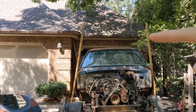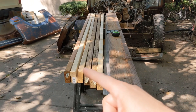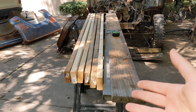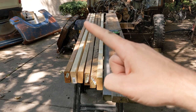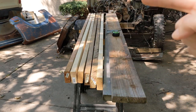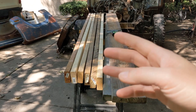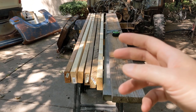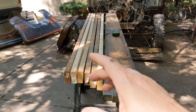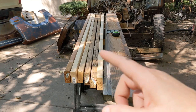It looks a little sketchy, but you'll see what we're building — it's going to work out just fine. I dug around out in the shed and found some lumber. I'm going to use three 2x4s for each of the uprights. These 2x8s are 110 inches long — more than 8 foot, more than enough length to go across the distance of the truck. These two sandwiched together will be the header that goes across. So basically, three come up, the 2x8s come across, and three more come down. For the legs, I've got some steel 2x4s — the material I used for making an engine stand. I'll use those for the legs, and I've got some 350 to 400-pound casters to move it around.